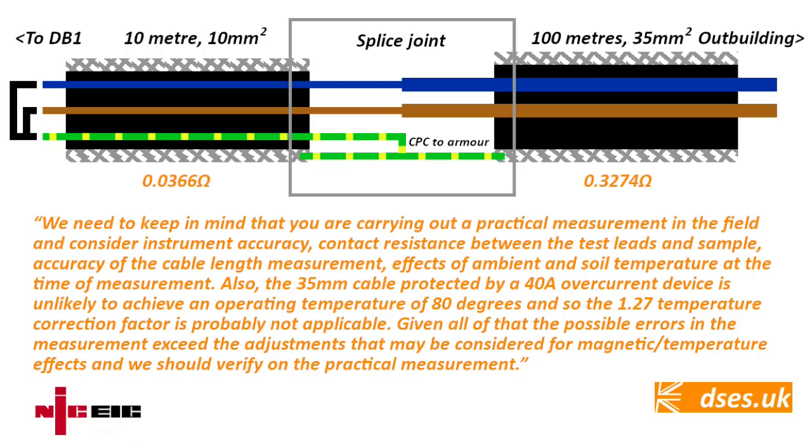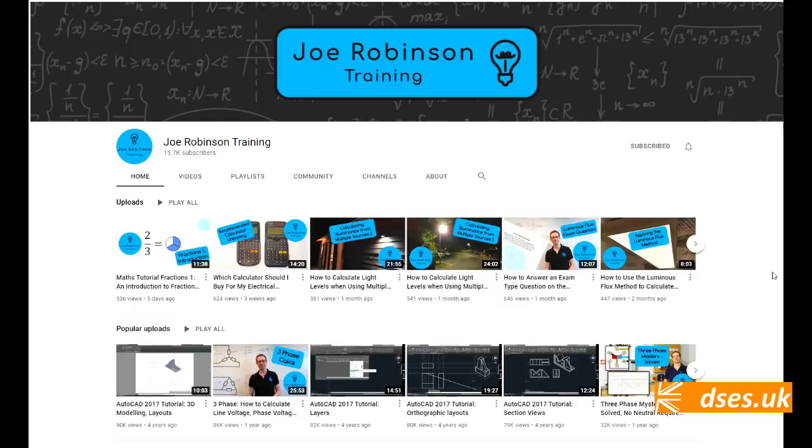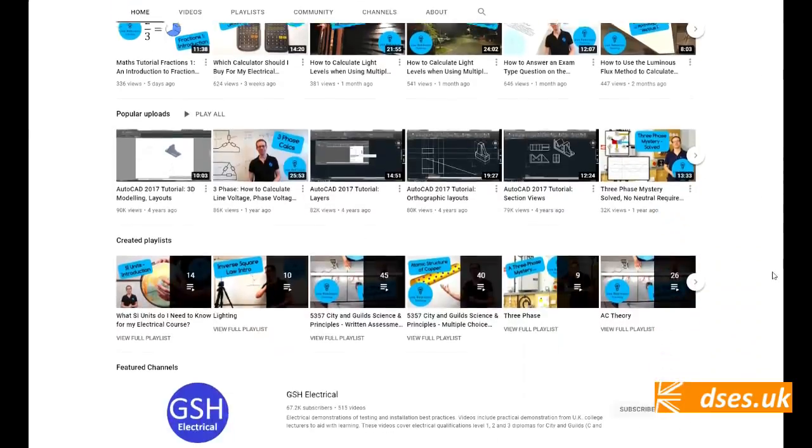Cheers, guys. And I know you know your onions, but really, I wanted to know why Result X on my ohmmeter was what it was and what GN6 was clumsily trying to get across in its stuttering, spittle-flecked, inelegant way. I also sought advice from Efix, as I know Joe likes to mix maths with electricity, and I was pleased that he too raised an eyebrow at the way GN6 is written. At least it's not just me reading and rereading the same damn paragraphs again and again. Joe thinks the formula, as I've applied it here, is correct, and that correction factors are omitted for the basic dead testing, although you'd apply them to get the figure for the operating temperature, which, as NIC said, would never be reached for a 35mm core on a 40-amp breaker.